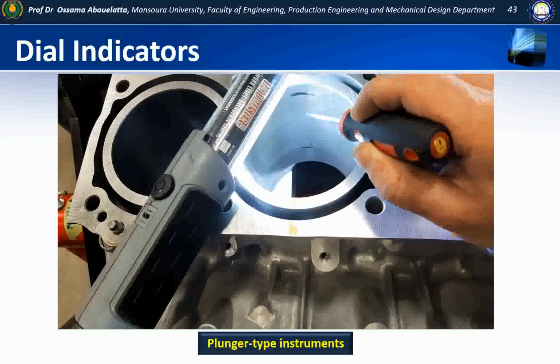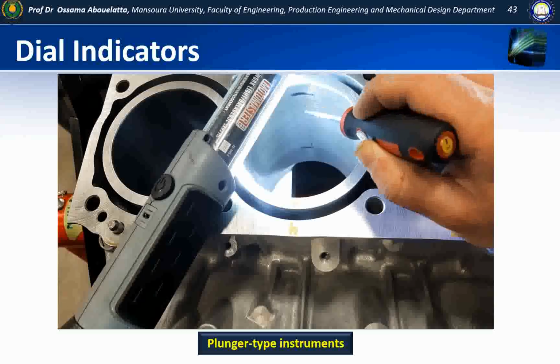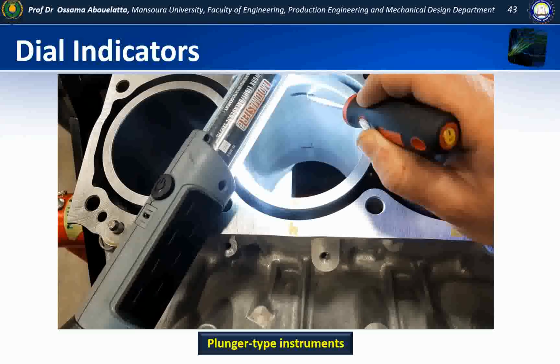And also, once we're at top dead center, on the compression stroke in the beginning of the power stroke, the pressures that the rings in the top of the piston are going to be subjected to are going to be our highest. We know that on power, some of the combustion gases will be getting behind the rings and forcing them out against the block. So the highest pressure loading that the cylinder is going to see is going to happen at the top, where we also have our lowest point of lubrication.